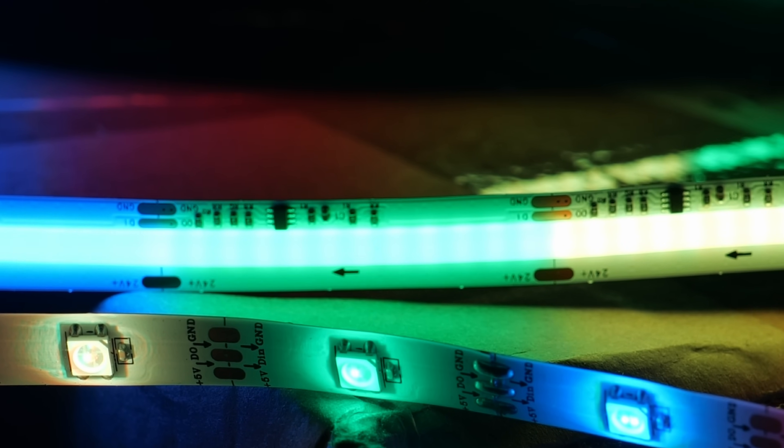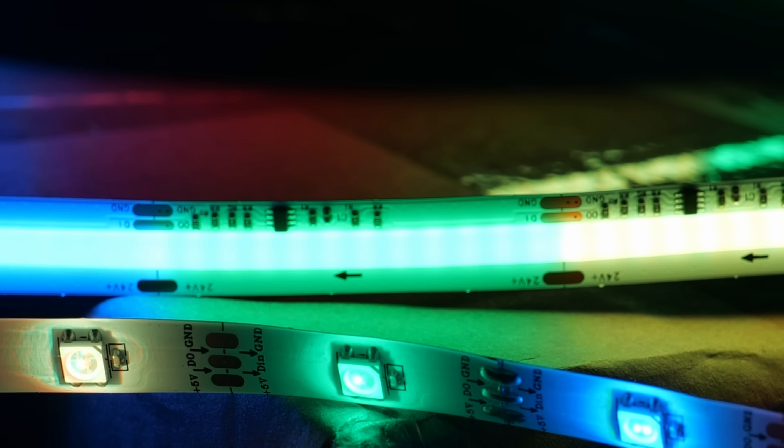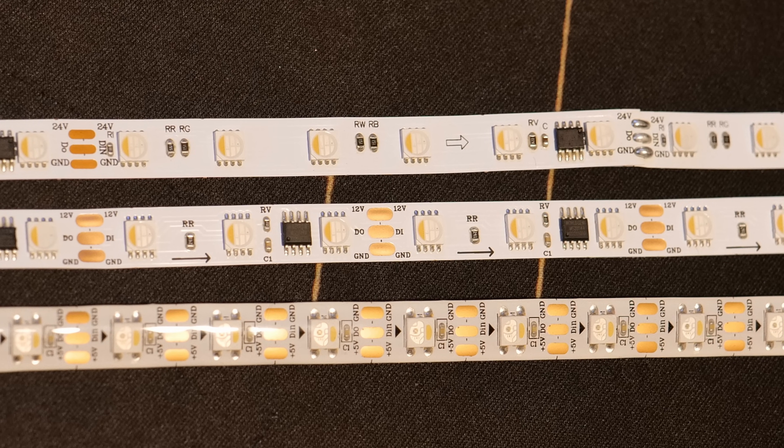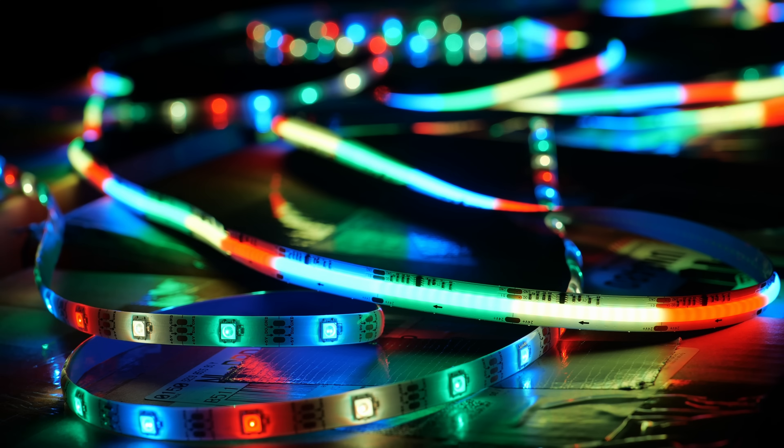So the sections as a whole light up in that color for that pixel, as you can see here. The reason for the sections or zones, as I generally call them, is the 24 volt. A single LED diode needs a voltage of around 2 to 3 volts, so 24 volt is way too high, and to drop the voltage they make a circuit and have lots of them connected in series, and each LED drops down the voltage to make it work as a whole. This is nothing new — all 12 volt and 24 volt strips have worked this way, with WS2815 being the exception. In normal terms, this means that at 5 meter lengths this strip has 100 zones, or at 1 meter length it has 20 zones that are addressable. On first thought you'll say that's even less than 30 LEDs per meter, which we've already had for years, and I use 60 LEDs per meter or more everywhere. Sure, that is partially valid, but in this case I'd actually challenge that argument.